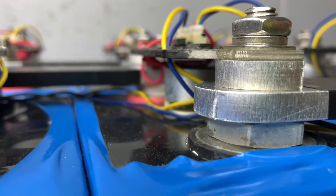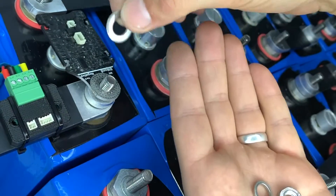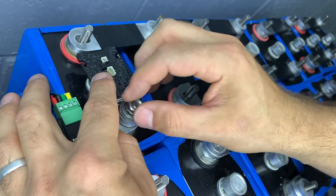So what you can see here is we start from the cell, then we have the cell bus bar, from that we go to a standoff onto the BlockMon, from there a washer, a spring washer, and then finally the screw.